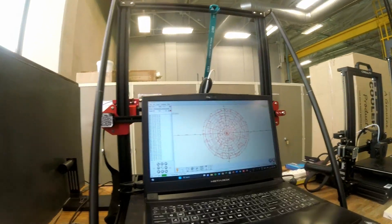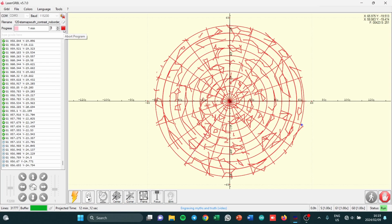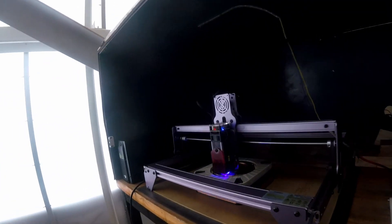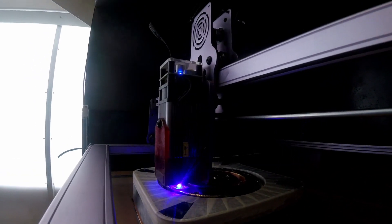We also have the program running here. We've made sure to set the center point to the center of our 3D print. You can currently see the laser running around about all the details. We've set the vectorized mode to just do single lines for us on the detailing, at 25% power — just enough to ablate the material to leave a fine trace. Simple as that, and with everything dialed in you will start seeing that image.